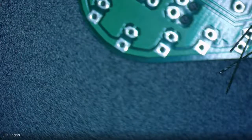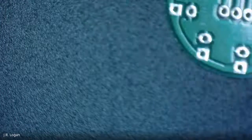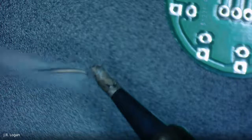Jarek, can you explain the tinning part again? Yeah, so tinning is simple. It's hot. You have your soldering iron, and you're adding just a little bit of solder beforehand. That's probably too much. You just want a little bit on there, and that's going to be a liquid that helps transfer the heat directly to the pin.